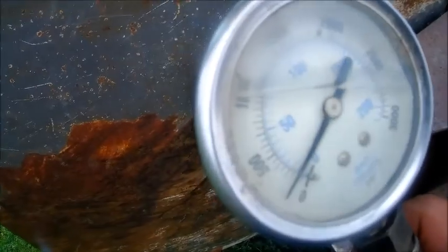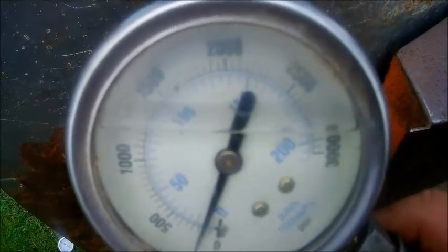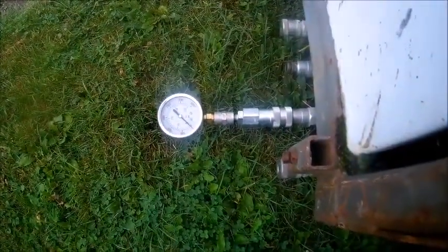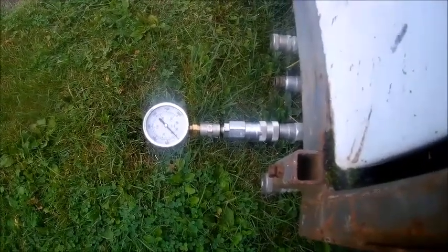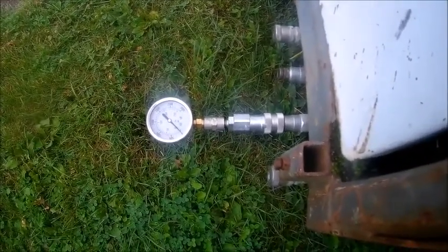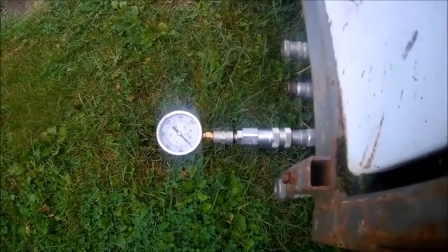Okay, we're working on our valve here. We got the pilot pressure, I guess, which is what you call it, set at 500 pounds, and we're able to adjust that easily. The main pressure, which we need for the conveyor to work, we can only get 1,000 pounds out of that. We think we must have a bad relief valve. So maybe we'll try to shim the spring and see if that is the problem. Or, I don't know, I have to call Multitek tomorrow.